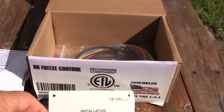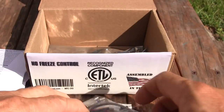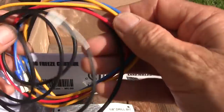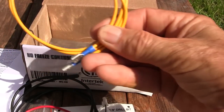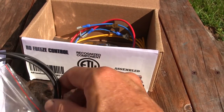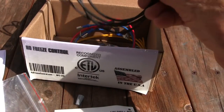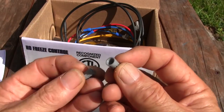The template helps when mounting onto a middle plate or blower housing. This is the wiring — it comes with the two wires you'll need to cut out your call for Y1, and also your 24-volt wires feeding the board, and the sensor that gets installed onto the evaporator coil. There's also a clip that clips the sensor onto a loop or tube, and a couple of small gray wire nuts.